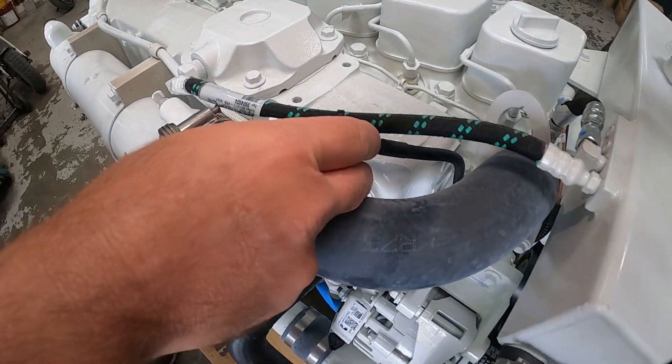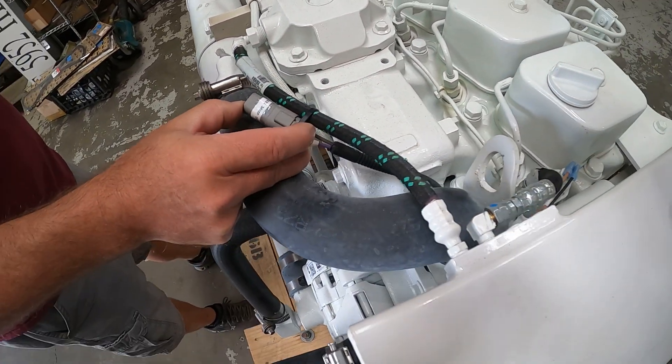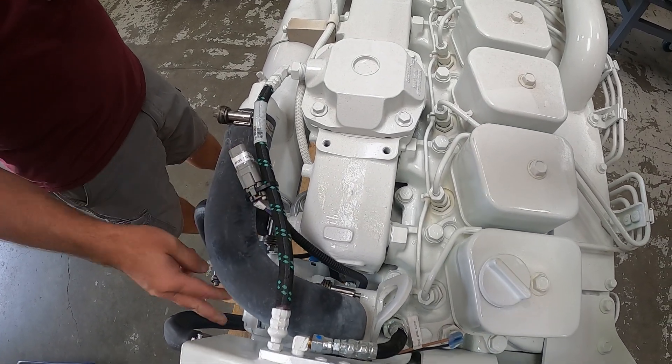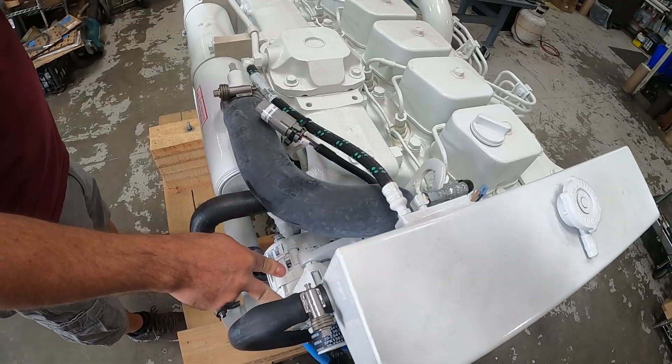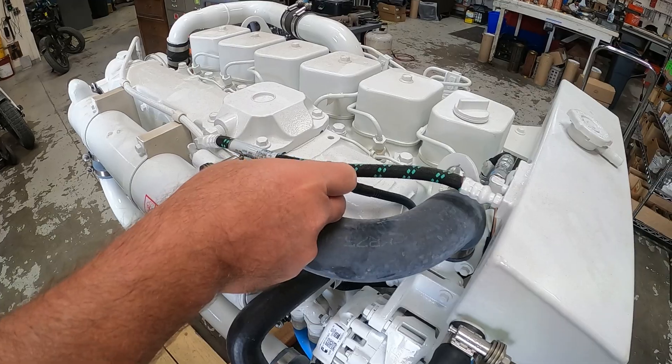What we have here is our diode. This is what prevents the engine from not shutting off. We need that diode so we don't back feed ignition power from the alternator to the engine. It prevents back feeding — if it back feeds, you turn the key off and the engine won't shut down. So that diode prevents that.